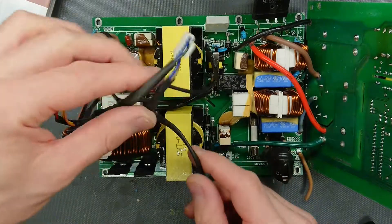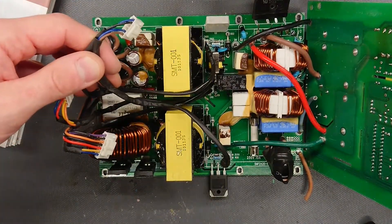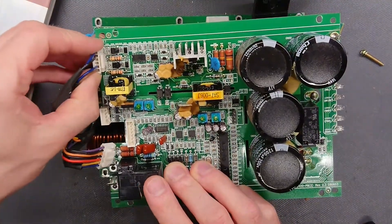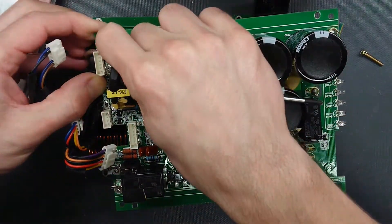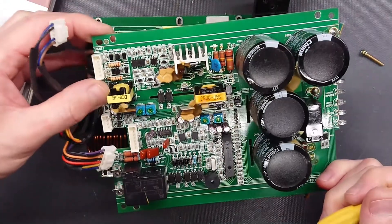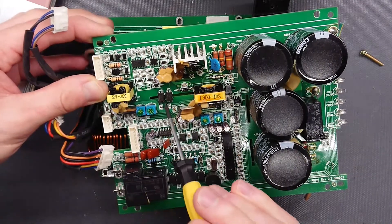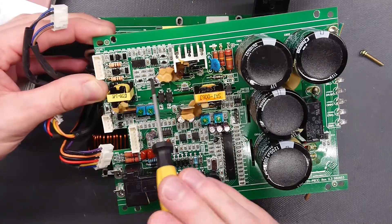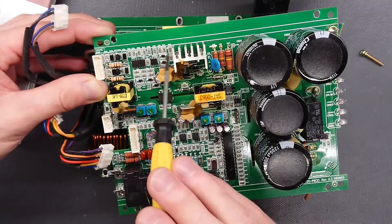These two wires coming here are the gate drive wires. As we can see, they were sitting over here up on the control board. That means over here we have two small transistors — those are the gate drive transistors and output transistors — and we have some gate drive circuitry in these ICs. These are the optocouplers to get the drive signal from the control circuit, and other than that it does have its own isolated power supply from these two.